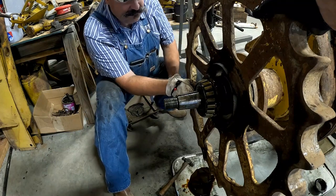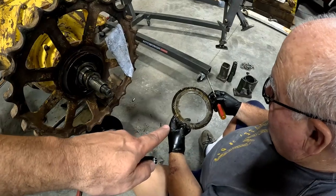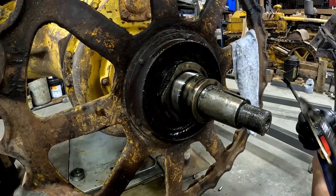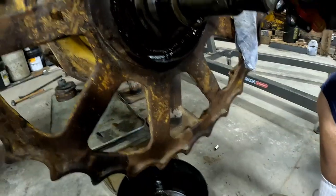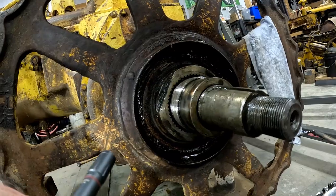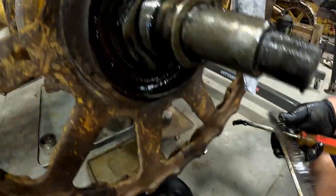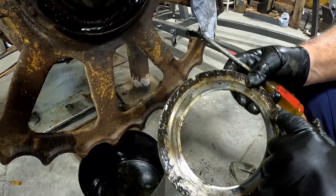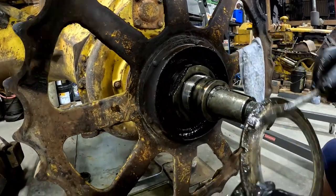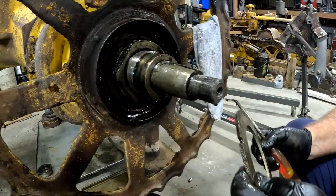This one's turning. Dad and I were just noticing when we took these off of 4G, there were these giant washers that go around on the inside of the sprocket next to where the bellow seal is on the pillow block, and inside of there there's cork. The cork on 4G was completely obliterated. You can see where I touched it, that it was sealed around here. This is the side that ran against the bellow seal — cork seal on the bellows right there. There are three dowels that lock in these holes here that keep this from turning, and your bellow seal turns on here.